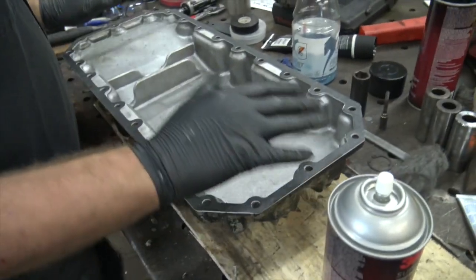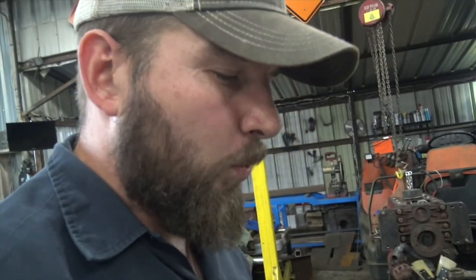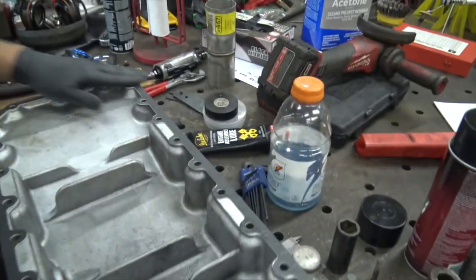I used to do this in the oil field all the time. If it's on something you have to take off frequently — like compressor doors — you glue the gasket to one side, then take some oil or assembly lube and rub it on the outside of the gasket. It sounds crazy, but it doesn't leak. It acts as a releasing agent so when you pull the door off, the gasket is in perfect condition and you can reuse it. Only do that with things you're planning to take apart — for an oil pan you're hopefully never pulling off again, just glue both sides.